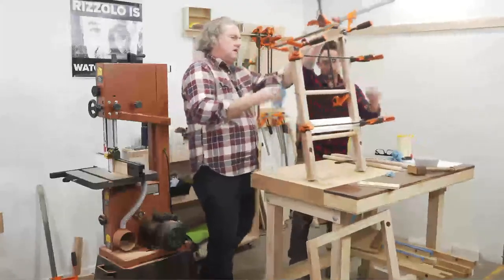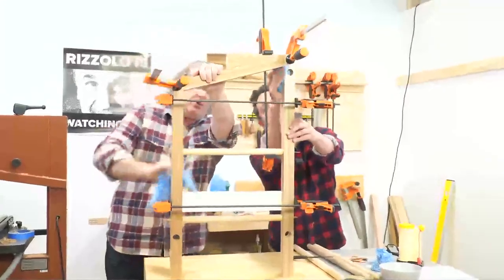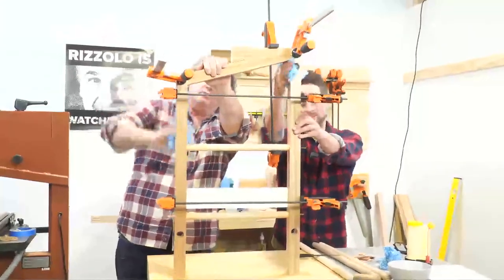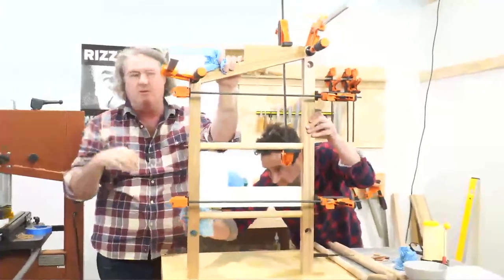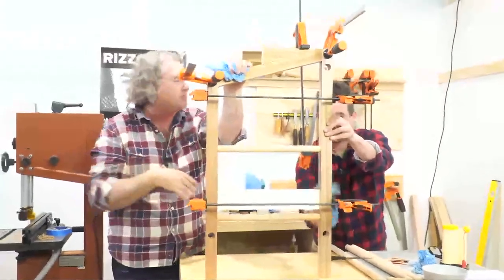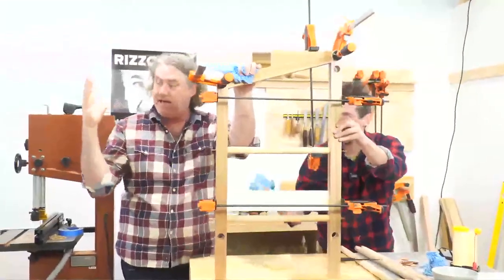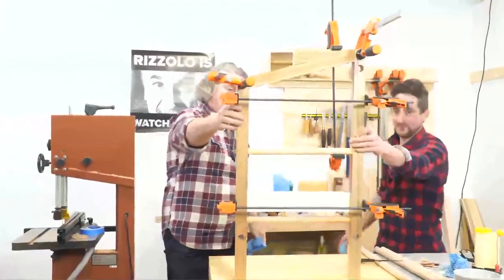All right, glue. Very important. Get all your glue off, or by the time you try to sand it out, you'll just ruin the form and it's just not cool. And if you think, oh, I can't see anything, and you put a clear over it, ping, it reappears, and then you'll definitely see it. Right, so that's looking pretty good.